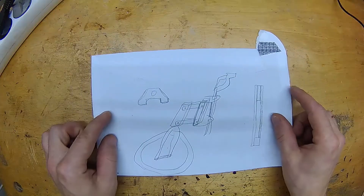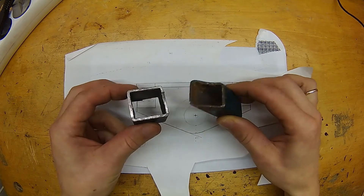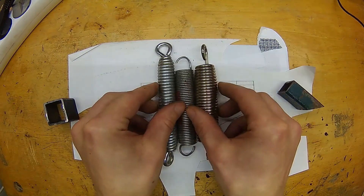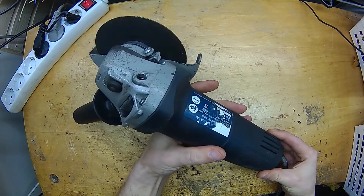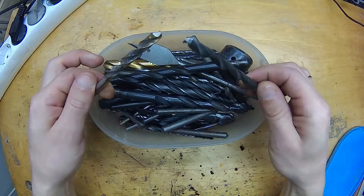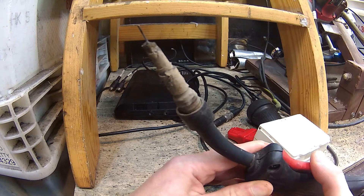Overall, it did take me a lot of time to come up with all of the measurements for this design. I did some drawings and went through a lot of material and spring options, but that is just the basic boring work when making a design like this — you just need to put some time into it and it will pay off. To make this build I used a grinder, a hand file, some drill bits, and an old MIG welder with flux core wire. Gasless flux core wire.